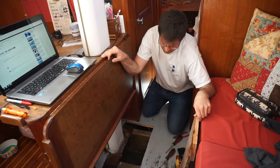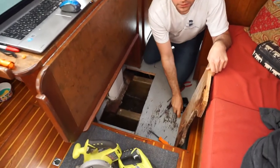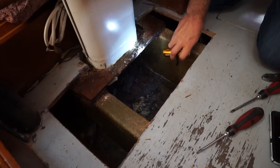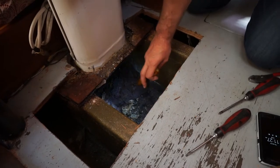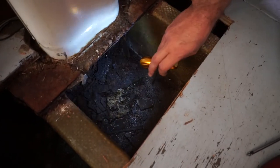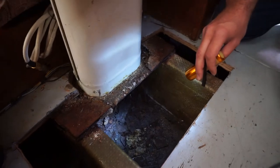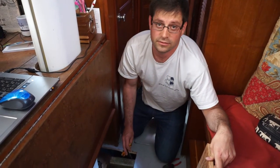You can see how much this has corroded away here. The metal is pretty thin and it actually looks like it might be bent here and here. Down below you can see all that is metal chunks that have come off of this mast step. I'm not even sure if the stringers are good yet. I'm going to have someone come pull some samples and tell me because I don't even know what to look for.